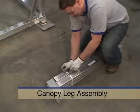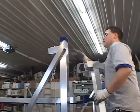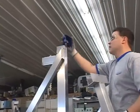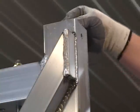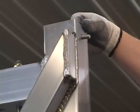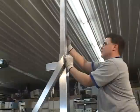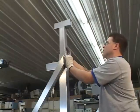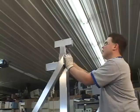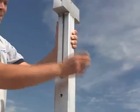Cut the ties holding the legs together in a bundle. If caps are in place, remove them from the bolt lift uprights. Mount the canopy legs with the bolt lift rack in its lowest position. Insert the 3/8 inch carriage bolts for the legs into the lift uprights from the inside, and loosely tighten using 3/8 inch flange nuts. Slide the canopy leg with its slotted side onto the carriage bolt and insert the leg into each lift upright. The slotted leg fits over the carriage bolt head. Insert the leg to the desired height and tighten the carriage bolt. Repeat this process with each canopy leg.